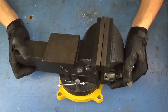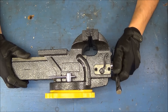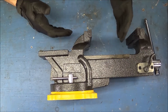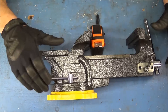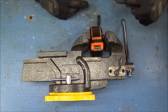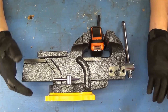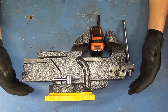The unique feature is this quick-release lever. When you remove the pressure from the bolt, you can just press that lever down and with one hand slide the entire mechanism right open. If you put something in — like a tape measure for example — you can slide it back shut, and it will ratchet back shut very quickly. Then you can tighten it down fully with the actual handle. For a homeowner or DIYer this would be a good option, and I plan on using it in future videos to show long-term performance.